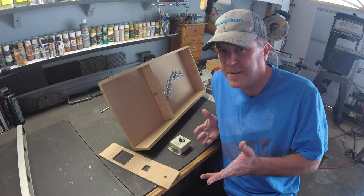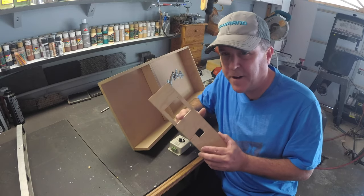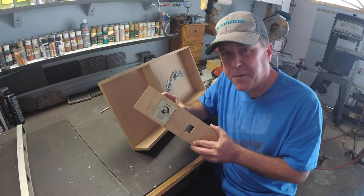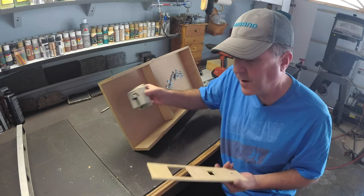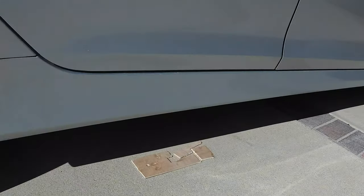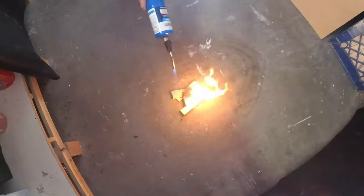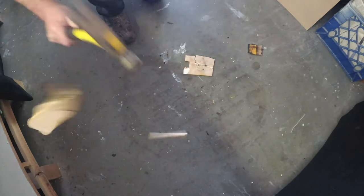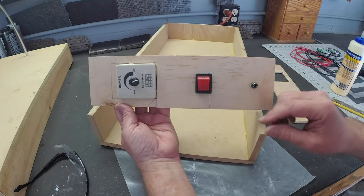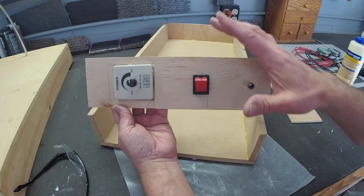I just realized that I made a mistake — I'm man enough to admit it. I cut this hole the wrong size on this faceplate. I intended to put the dimmer switch up and down like this but I forgot that it will not fit in here like this — it has to be sideways. So am I upset about it? No. Do I have to redo this? Yes. I've got the new faceplate here and I've had to cut it so that I can mount the dimmer switch sideways. If you want it to go up and down you're just going to have to make your table a little bit taller, maybe three and a half to four inches.